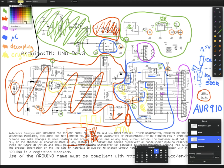So the very last thing that I want to talk about, which will be very brief, is the UART. The UART is the way that the microcontroller can talk to the computer. We already spoke before about this USB thing that basically does some magic and can send the signal over UART via USB. It's really important that the RXD pin, which here says MBRXD, or maybe it's an 8, not sure, but basically that's the microcontroller RXD.